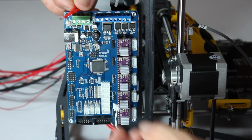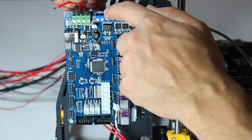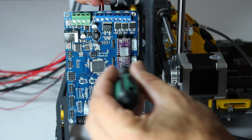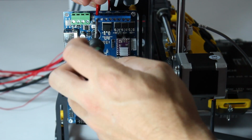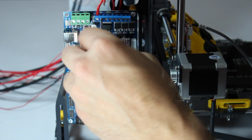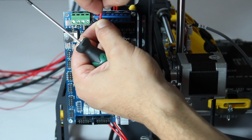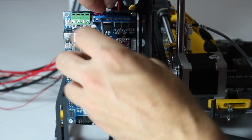Back to the motherboard. This step is simply screwing in the 2 wire ends that come out of the build plate. Note that on the motherboard you can see H-bed written upside down indicating where the wires screw in. You can attach either wire to any one of the 2 connector terminals since neither wire has polarity. Simply unscrew to open, screw in to lodge each wire in place.